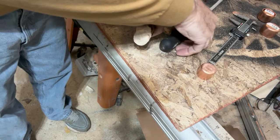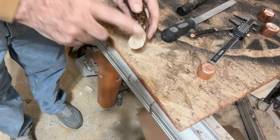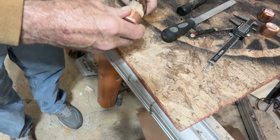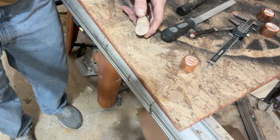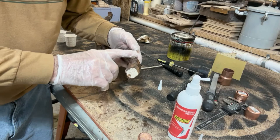We'll do a little bit more off this area. Remember it's rough from the file, so I'm going to take some 150-grit sandpaper and hit that to get it ready to stain and put more finish on. Right now it slides on there real nice and we can glue it down snug against the shoulder.